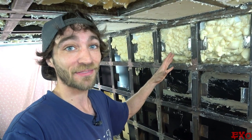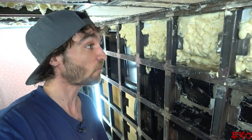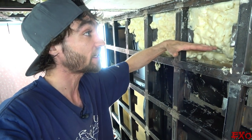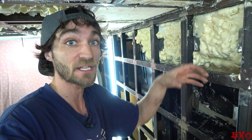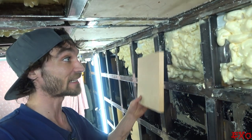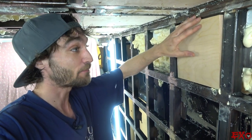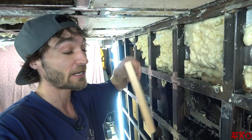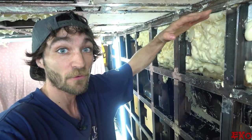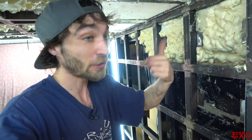So let me just reiterate one more time what exactly the method is behind all this madness. We got some on the roof, we got some madness on the side. So let me just visualize this for you real quick. The reason why we had to bring the foam all the way down to this point is because we're using two-part activated pour style foam. We wouldn't be able to get all of these cavities filled up if we were to dam it up with the wood that needs to go on there. How could I possibly fit a cup and pour liquid behind that with a barrier? It would be impossible. So that's why we brought the Great Stuff expanding foam down to this point, and it is touching every barrier, including the sheet metal of the vehicle.